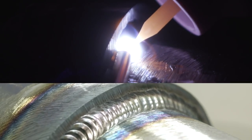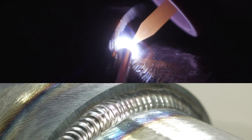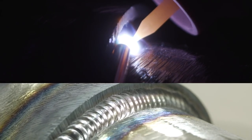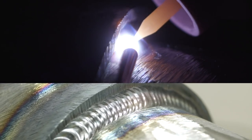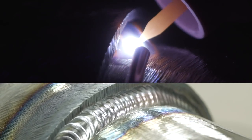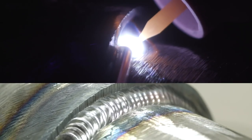You're making sure your toes are wetting in on the sides really good, and making sure your puddle at the root of the fillet is wetting in really good. You're not running too cold — your puddle is nice and wide. If you're too cold, your puddle won't be flat, it'll be a little bit convex and narrow. I'm aiming my torch at 45 degrees in the middle of the joint with about a 5 to 10 degree push.